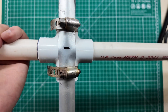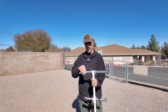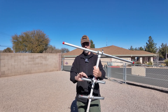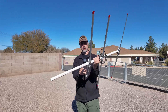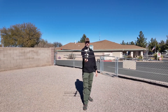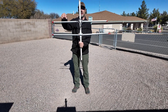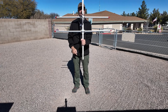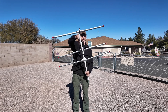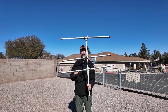Let's go outside and take a look at what this looks like — I am braving the polar vortex for you. This is the tape measure Yagi that we just talked about inside. I fold in the elements on the end so that they are out of the way in storage, and then they fold out and there you go. This one up top is considered a director. This one here is your driven element, and that is where your coax attaches. And this one down here is considered a reflector.